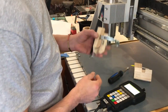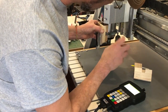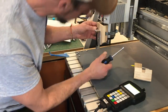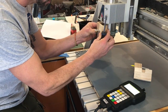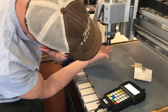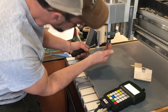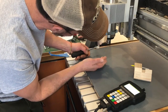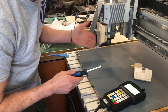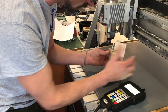Let me show you how simple this setup is. Hose clamp — tighten it down on your spindle. That simple. If you have a router instead of a spindle, you'll have to figure that one out yourself. You just want to make sure your pen tip is lower than whatever is on your spindle body. If you have the collet nut on, keep it low enough to clear that as well. I'd recommend a half an inch minimum, but as long as it clears. The second holder sets up basically the same way — the hose clamp just goes right around through the groove and clamps it to the spindle.